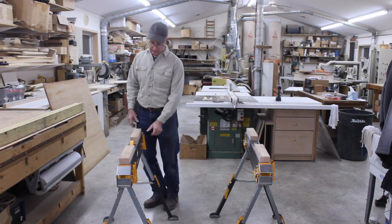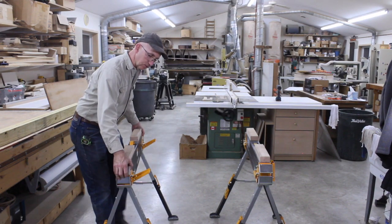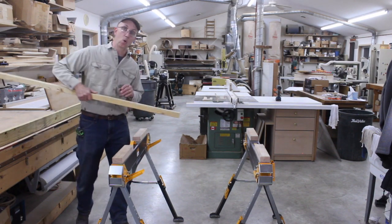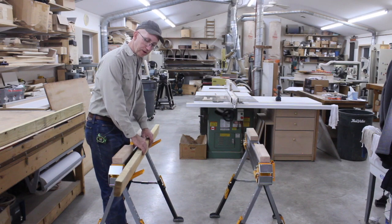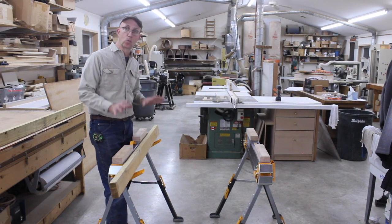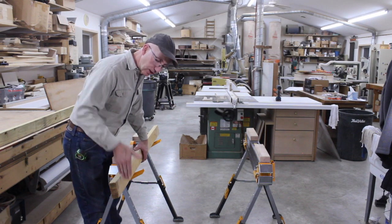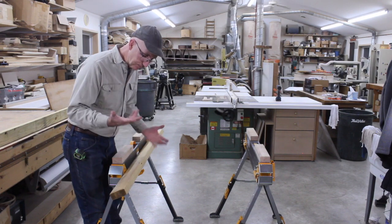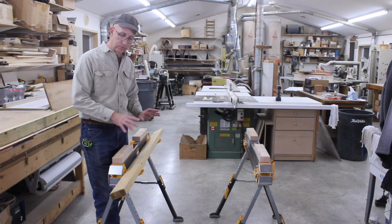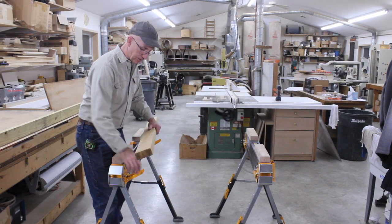The first one is that it has two little flip-out steel levers there, and they flip out, and they are intended to be able to hold a 2x4 or a 2x6 or even a 2x8 in there, so that if you just have one sawhorse set up, you can put your lumber on there, and you could cut it, and you could dimension it lengthwise through just having one sawhorse up. So that is that feature there.